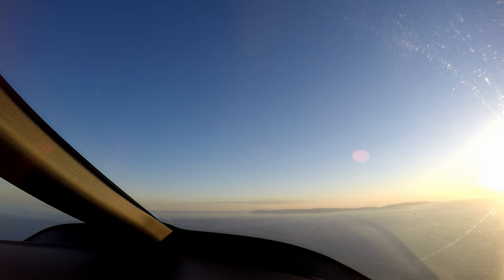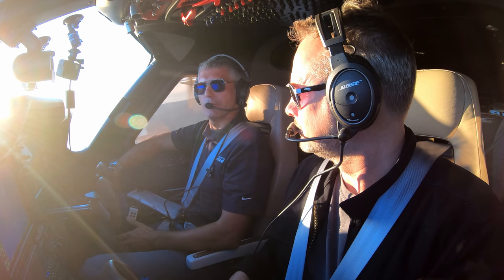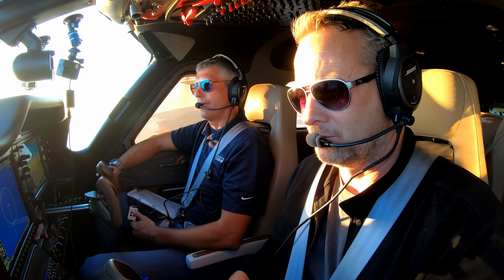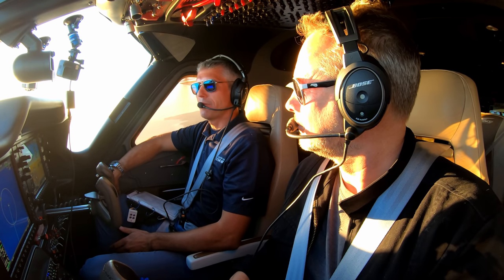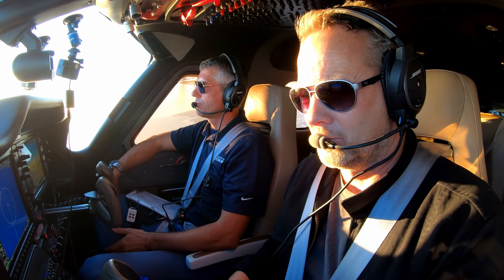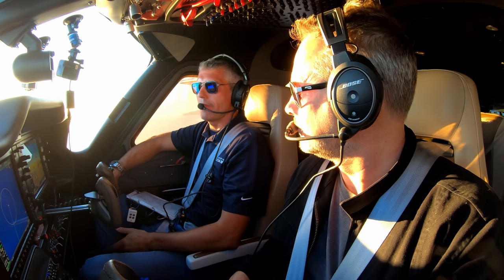The other family is the special mission platform, which is based on a configuration with 5 operators, up to 2 pilots, it's single pilot rated, and 2 hatches with mission power. In that case, you can install almost any size sensor, up to a 20-inch EOIR payload. You can have ground radar, search radar, all sort of equipment like AIS, direction finder, etc., to provide a special mission platform capability. Also, any type of terrain mapping payload, ground mapping payload can be installed on the frame, and 120 amps at 28 volt DC provide power for almost anything you need to power in this size.